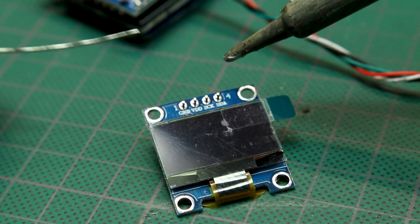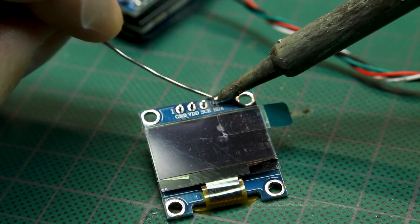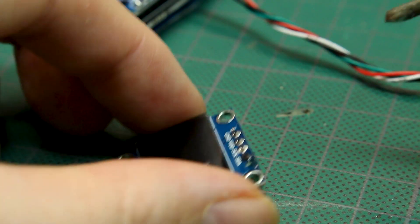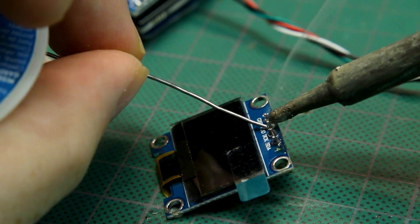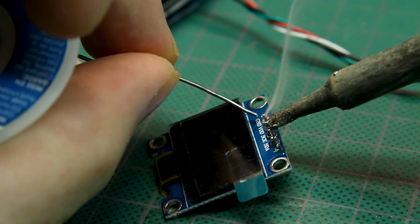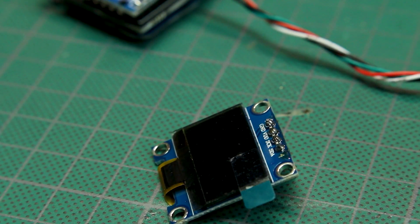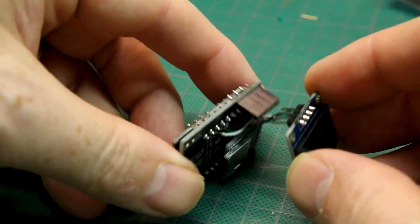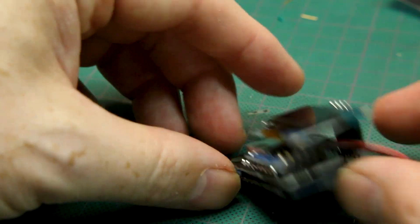Our OLED interface just has serial data, serial clock, power and ground — we'll put a stackable header right onto that too so we can just plug it into the other one. Even if this prototype wasn't going into use, I like going with the headers and everything easily removable, because we haven't tested the board yet. If it ends up being wrong, this is super easy to break things apart, do bodge wires, do rerouting.